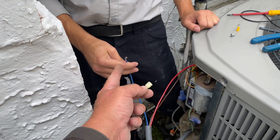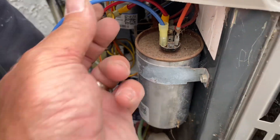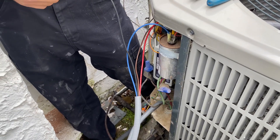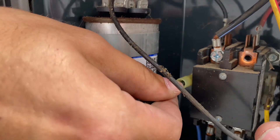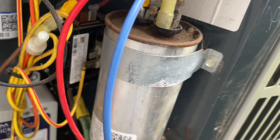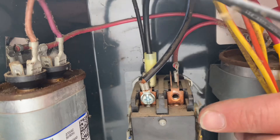The next step is to connect the blue wire from the ICM 870 to the run capacitor terminal, making sure that our terminals are clean of any rust or debris. The blue wire is now connected to my capacitor HERM terminal. Next step, we're going to splice the ICM 870 black wire to contactor terminal T1, L1, opposite the red wire on the top of the contactor. Now our black wire is connected to L1, T1 on our contactor.